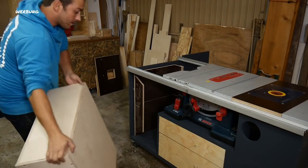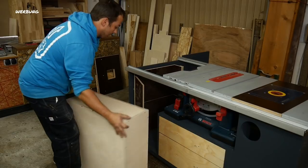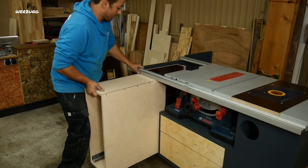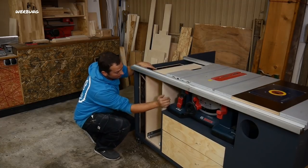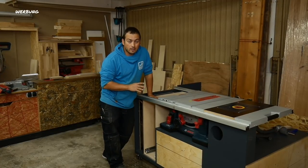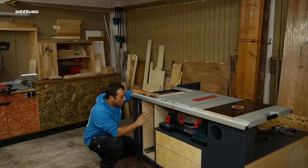All of this didn't take me even an hour. It shouldn't fit in now because the front part here is deeper than the rear rail, and at the back it also sits on those 8 mm that I cut in. And now it sits in there. The box down here stays — it'll be oiled, not painted. The front will probably be painted, but I'm not sure yet. Actually I think I'll leave it all oiled — the front too. Otherwise it'll be too dark for me.